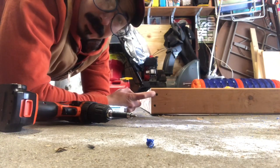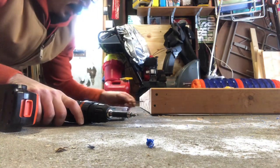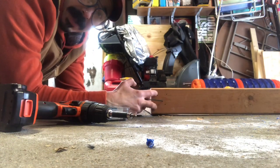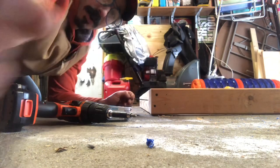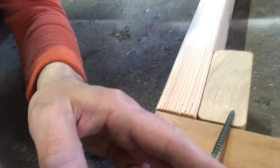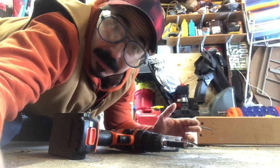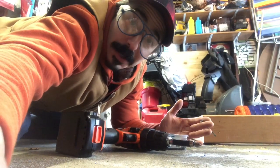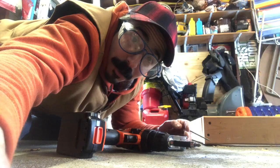With the existing screws in, I'm adding two screws into each block from one direction and one more screw from the center of the block on the inside to hold the whole corner — so three screws per corner total, glued and screwed. I'm no master carpenter and I'm sure someone is screaming at their screen, but these are my basic carpentry skills with my low-end tool set and this is what I'm doing.